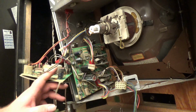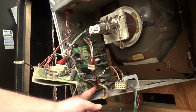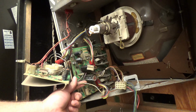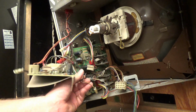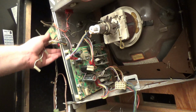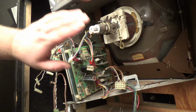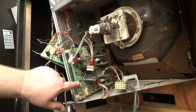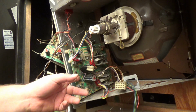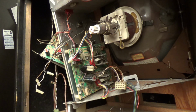But what I'm going to do is, by the way, not all of these have this, I'm going to take off this little plug right here. Take off this little plug right here. Take off this little plug right here. Now the deflection board is freed of the neck board. And by the way, these three plugs on the terminals are labeled. One will say brown, one will say black, one will say white with blue tracer, right on the deflection board.